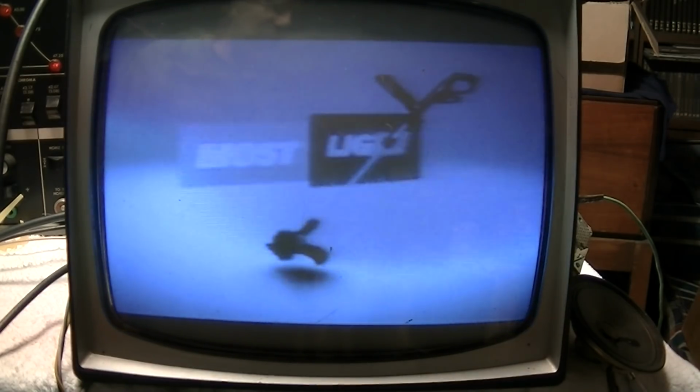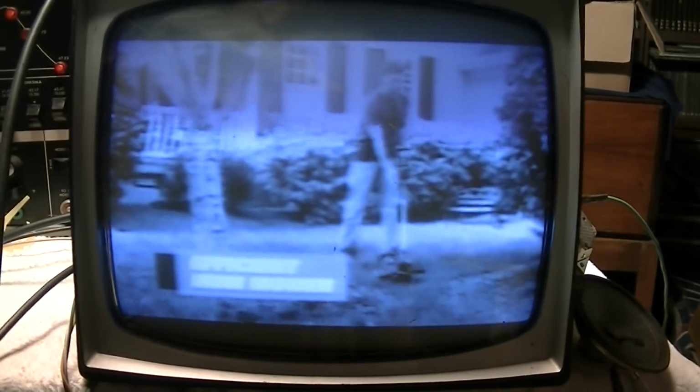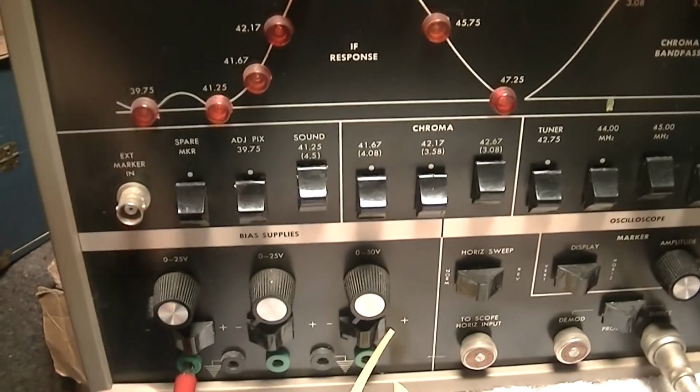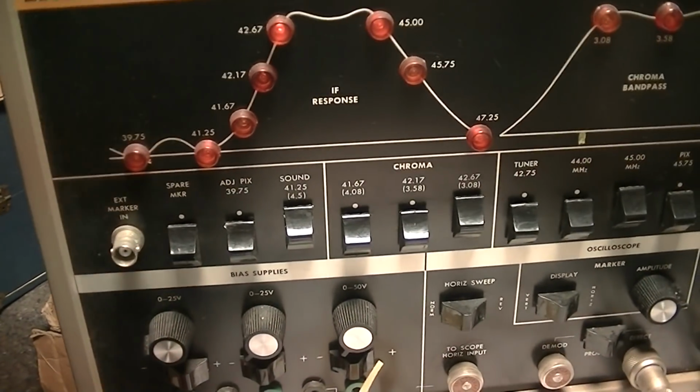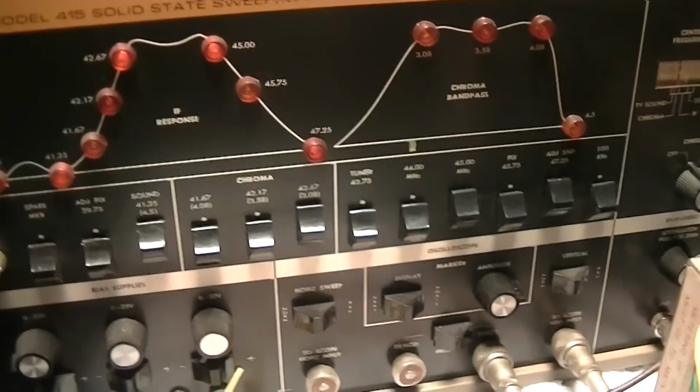And this is why in the first video, or the second video, I thought we had an AGC control problem. Well, the reason why I think we have an AGC control problem is because the transformer's open and it's not developing the right voltage. So anyway, yeah, this is the marker generator, and this is the AGC adjustment. So I got it hooked up to the scope. Let's give it a signal and see what happens. And the head adjusts a full 90 degrees.